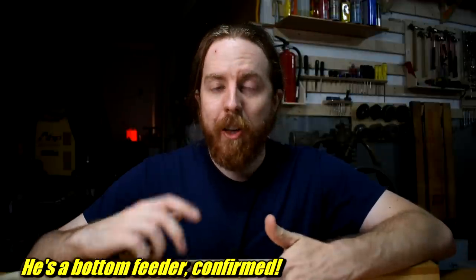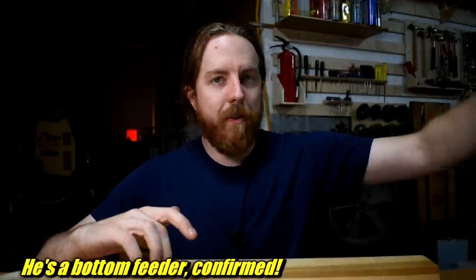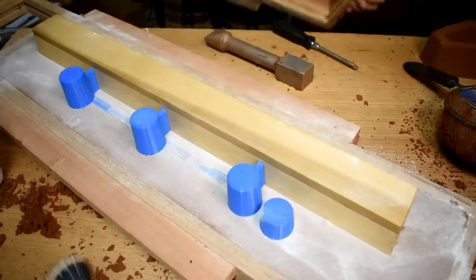It's going to freeze top down, so I tried to feed from the bottom using feeders up to the side. It didn't work. My final result is usable though, so I'm not doing it again. If this were a smaller part I'd do it over and over until it was perfect, but no. I'm going to take the ugly side of this casting, make it the back, and never have to see it again. Problem solved!